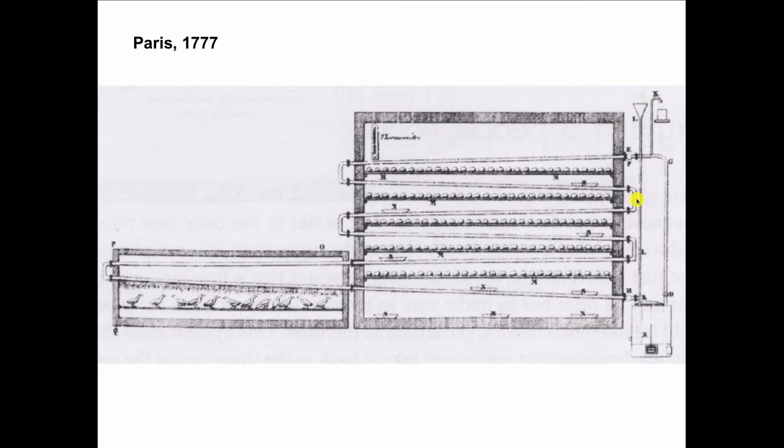So there's the fill valve, and look over here. We've got this pipe that comes over the top, and it goes into a tank to catch any excess water, because when we heat water, it expands, and suddenly you've got more water than you started out with when it's cold. So we have to have a place for that excess water to go. And up here at the top, you see the very first, what comes to be called the expansion tank.